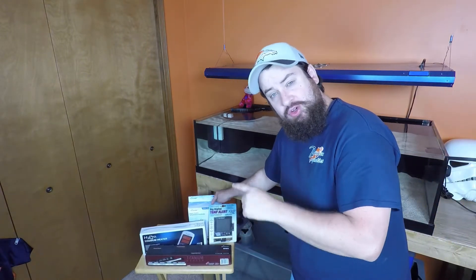Now let's take a look at the Phenix heater digital controller. As you can see, we're at 79 up here — nice LED display. For the buttons, we have on/offset, our alert low, and our alert high. We can change between Celsius and Fahrenheit, and then we have the plus and minus to make our adjustments. To set the temperature, we just hit the set button — it's going to start blinking. We go up or down accordingly to what we want. Hit set again to set it, and then for alert low, again we just push it.